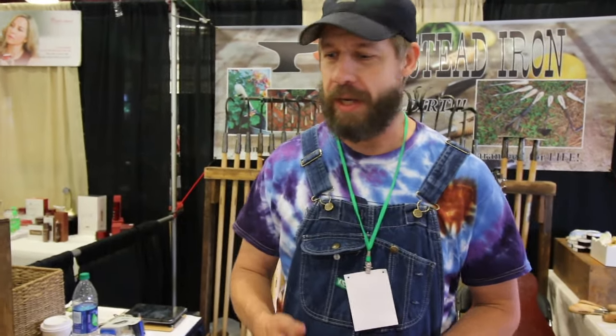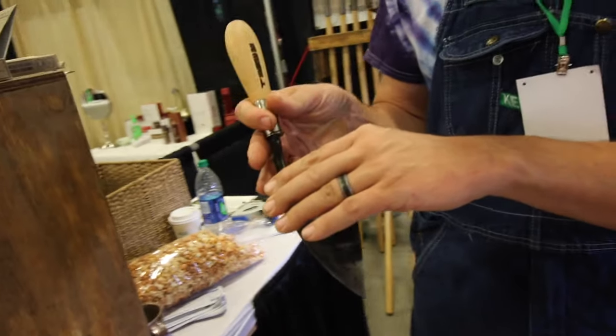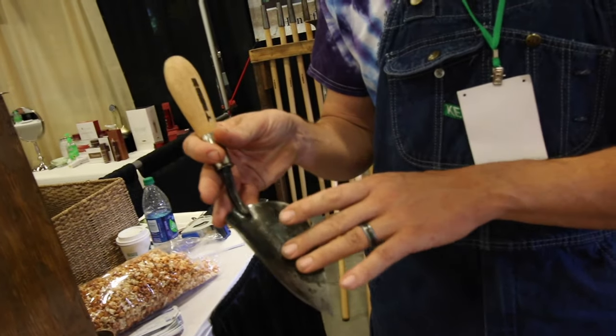So what's your process of making all these nice fine tools? Well, it varies a little bit from tool to tool, but the first step is the forging. We start forging all the shanks first. The blades — I cut these blades out in a plasma machine. We buy this in 4x8 sheets.